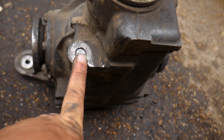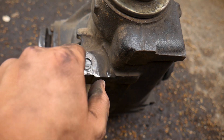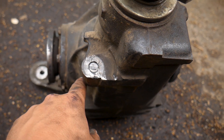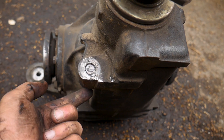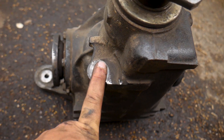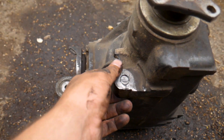These are two different bolts in here, and this one's way bigger than the one originally in there. I'm gonna have to drill all the way through for the rest of it to put the bigger bolt in all the way through so I can put a nut on the end. Hopefully a bigger bolt will fix this issue.